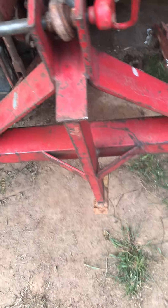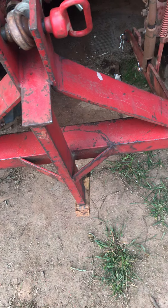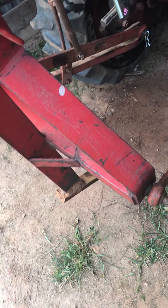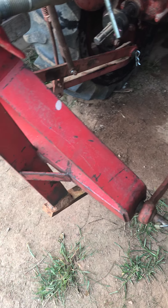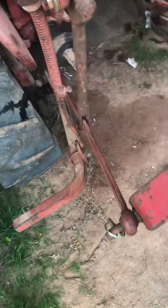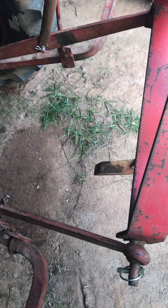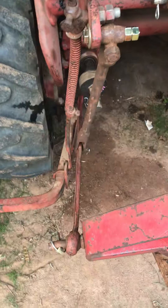I've got a subsoiler and I'm going to use it on a piece of new ground, probably about an acre. I'll video that. I need to run the subsoiler, and them chains worked fine until you use a piece of tillage equipment. I tried that with a cultivator frame and I got a little blooper video of that. What happened was it wouldn't go in the ground — when you hit the chains, the arms would just flop up, get slack, and the thing would just dance all over the place. So I need to solid these hitch arms up.